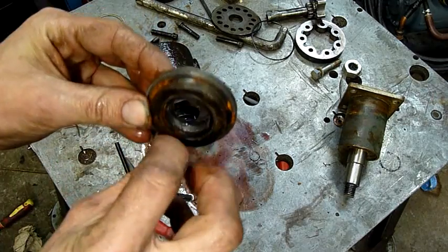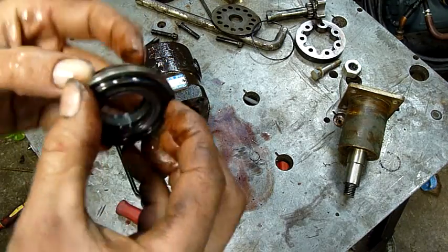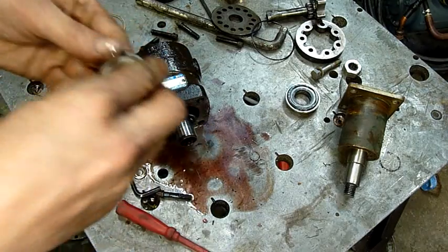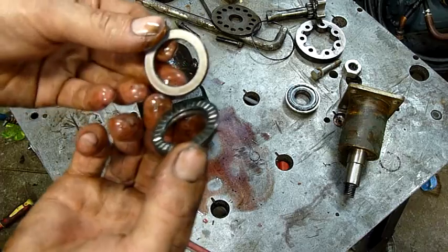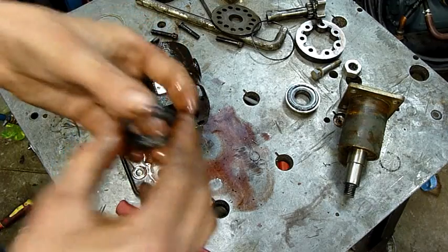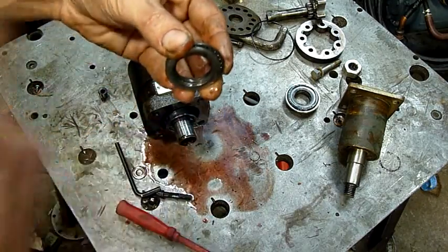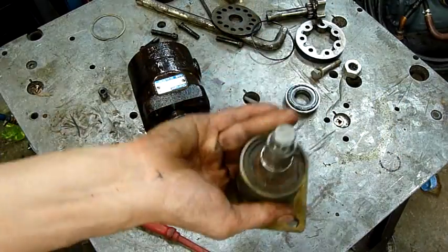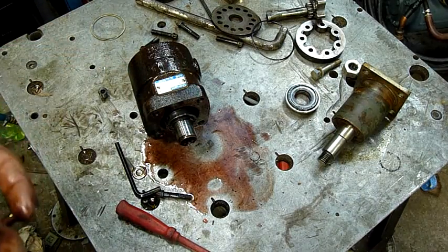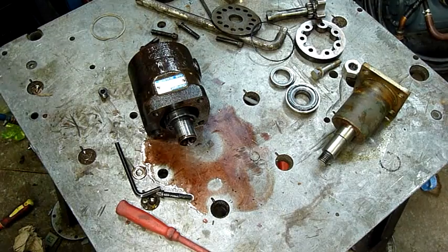So there's a front main seal assembly — there's an inner and outer seal. That there is a thrust bearing. Thrust bearings cannot take radial load — they only take thrust load, so they're designed to push against. They cannot take actual radial load. That's what a normal ball bearing race is for. And normal ball bearing races like that are terrible at accepting lots of thrust load, so you've sort of got to compromise with a tapered roller bearing in that case — or two of them.